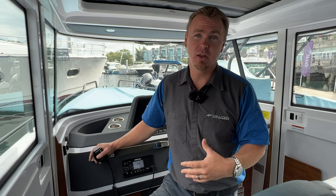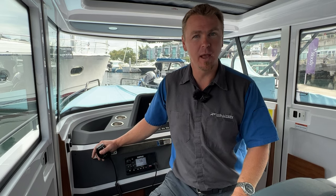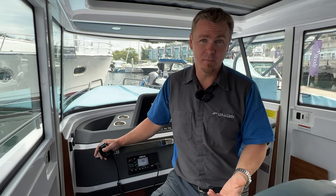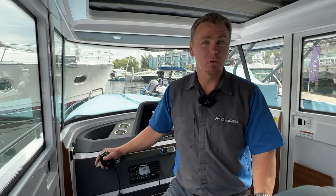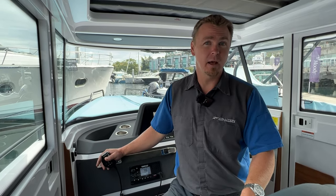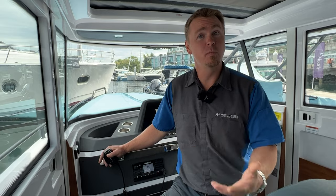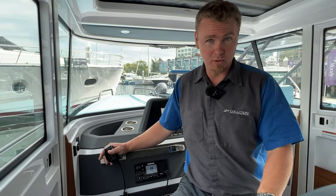Okay, so let me interrupt my own video here with another piece of information, and probably the most important thing that there is, and that is how to make a call. We realized we went through this entire video and I neglected to make a live call during the video to show you exactly how it works and how to test the capabilities of your VHF to make sure it does work. So when I do that here in this region, what I do is I call 83 Alpha. I will talk later in the video about those Alpha channels, so stand by for that. And we will ask them to identify that our system is working, and we will thank them for their services, and then we will move back to channel 16. So come with me as I do a quick radio check on channel 83 Alpha, which is the Coast Guard.